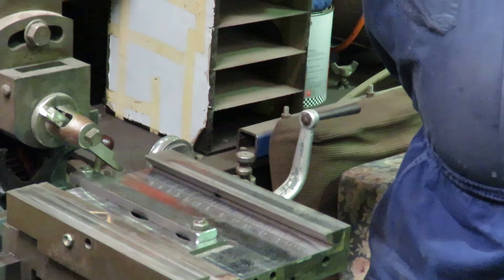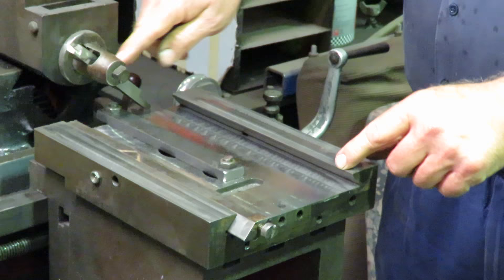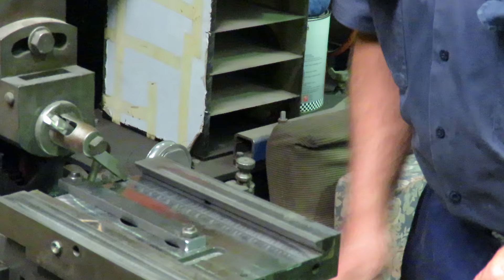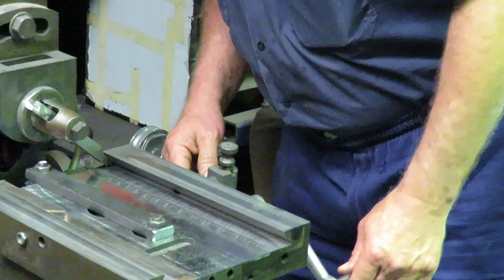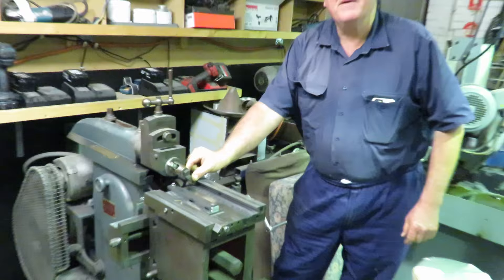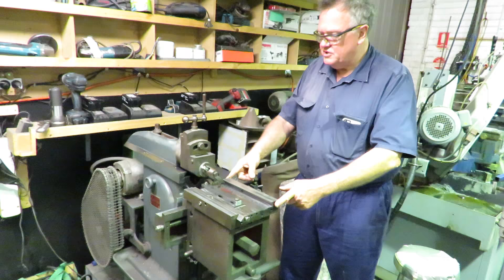Just show us those edges, Fred. Basically the gib strips are tapered, so there's a taper here — they're not the same. So I've done each one separately. I've set the tool at an angle so that it will come through and just adjust — it'll move into that edge so I can relieve the extra material in the corner without actually touching the dovetail surface, which we want to leave as is. The shaper is very good for this sort of stuff because you can just grind the high speed steel tool down. There's more tool overhang than I would like, but I've backed it with another block of high speed steel as a stop. Being as I was only taking a sliver of material out, it worked fine. This is almost the whole stroke on this shaper to do this.